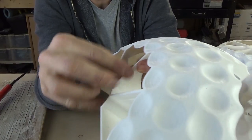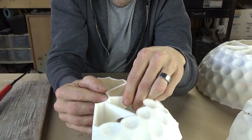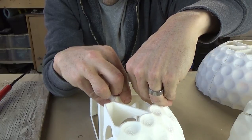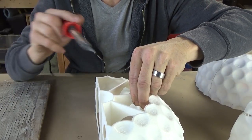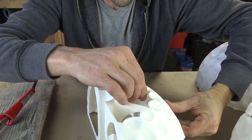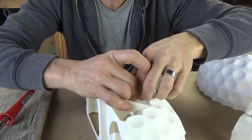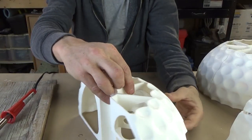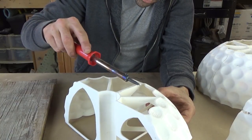What I do is pull the parts together — let me tilt this down a little bit — and line them up as closely as I can to where they look decent. Then I basically just tack the surface. I'm not melting a huge amount, just getting the surface softened up and a little bit stuck together. While it's still warm you can position it the way you want, blow on it, and it cools down and solidifies back up very quickly. Now your pieces are sort of joined and you can trace around the seam.